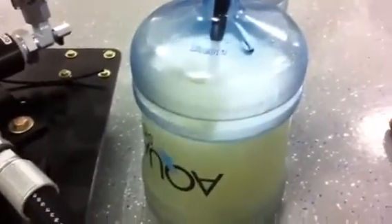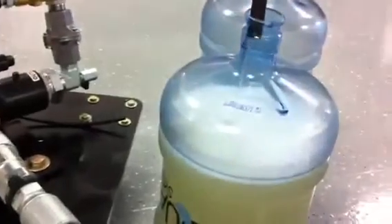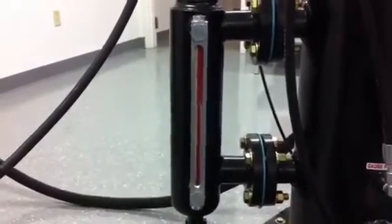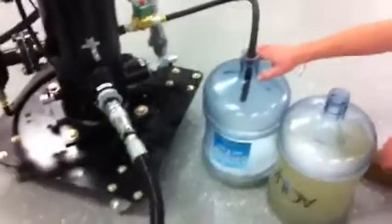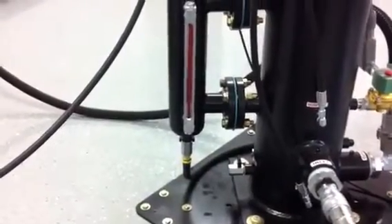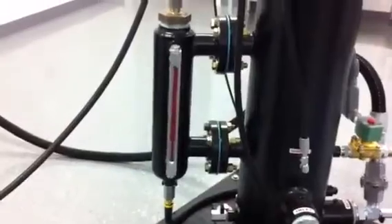While we're draining, we're still separating water from the diesel. We see that the water level got to the point where the specific gravity float closes the normally closed solenoid valve, and now it's filling back up again. Then we hear the solenoid valve click open and it drains more fluid. When the solenoid valve is closed, more water can collect in the bottom, so that process just repeats until we're no longer pulling enough water out.